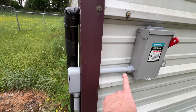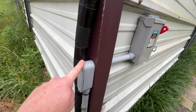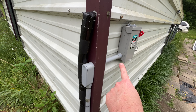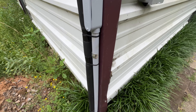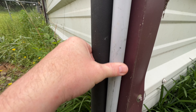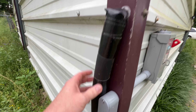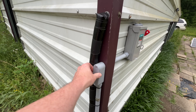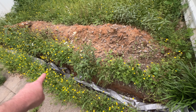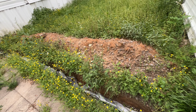It's running into conduit. I did have electricians come out to do this — this was the connection point between the inverter and the service panel. It runs through this conduit, which I believe is one inch, and through that into the service panel, into a 30-amp disconnect.